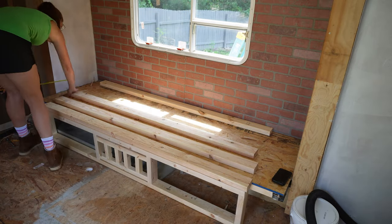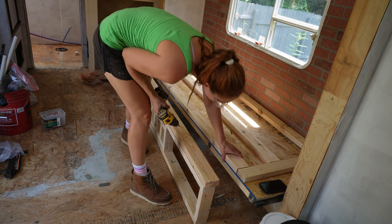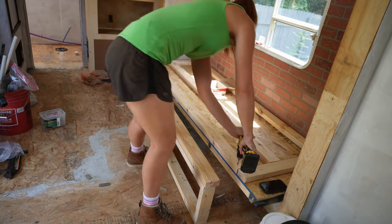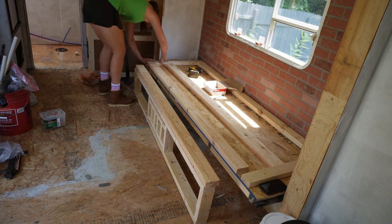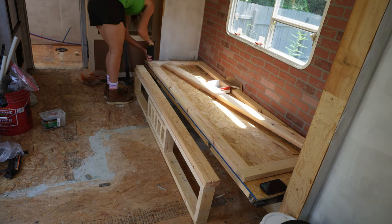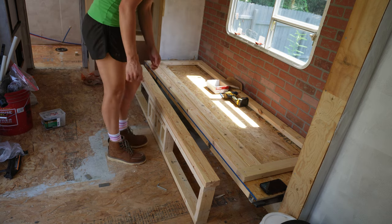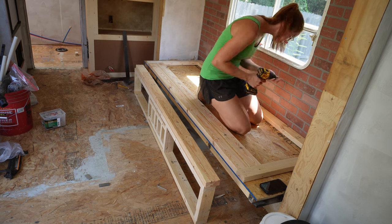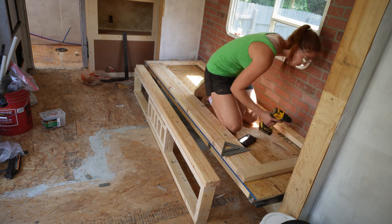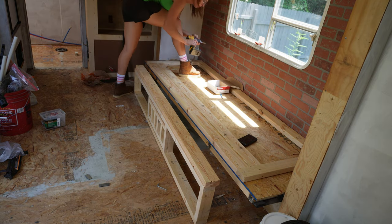So this is a lot of two by fours cut to the same length as the actual frame — it ended up being 77 inches for four pieces. What I'm doing is making a giant rectangle that will be screwed directly into the slide, and then there's a piece of wood in the middle that is not screwed into the slide — that's going to be the slider part. The reason I make this rectangle is because I want to make a giant cage for this sliding piece: I don't want it to slide left or right, only forward and back. If it's off even a little bit, it'll go cattywampus when you slide it in and out and it just won't work.